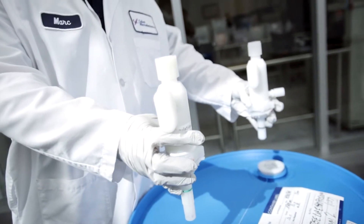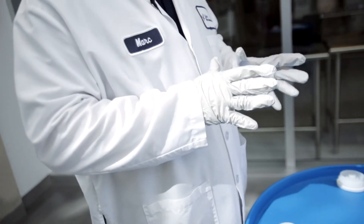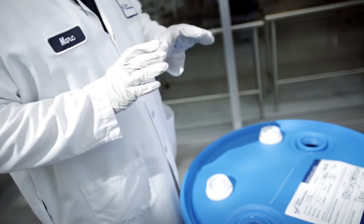The different types of dispense heads include some that are designed for separate feed and return. The dispense heads are inserted into the dip tubes in the drum, and the dispense head and dip tube combination needs to be suited for that particular drum design. Typically, all slurry manufactured in a region uses the same type and size of drum. If slurry is coming from a different region—such as Japan, Taiwan, or Korea—the drum design and bung opening will be different, so the dip tube and dispense head must be matched to that particular drum design.